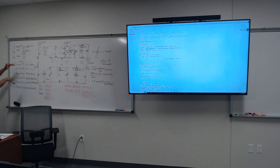Yeah, but what I did was section it. I did it in phases first to see how many amps we're pulling. And then we'll be able to tap on the light to these existing circuits if it's not beyond that threshold of 16 amps, or a 20 amp circuit breaker.